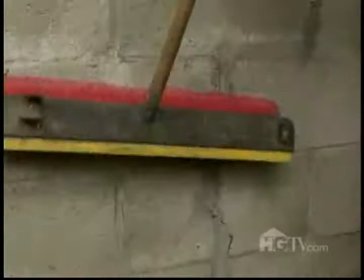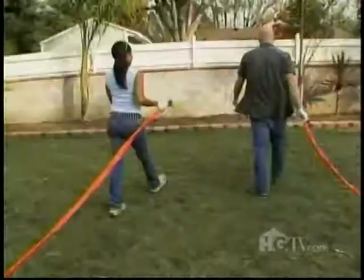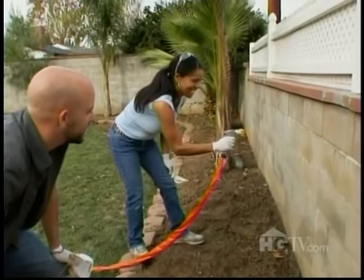Look, look what we have here. Count them. 1, 2 airless sprayers. Talk about overkill. We're gonna have this wall painted in no time flat. The airless sprayer uses a hydraulic pump to force the paint through the tube and onto our wall. You wanna, as you go, let go. Let go. Let go. Like that. Ready? Give it a quick swipe and see how it feels. All right, you ready? Yeah, a little bit closer. There you go, like that. Felt good. As it should.